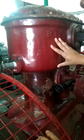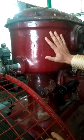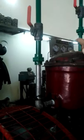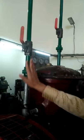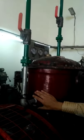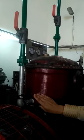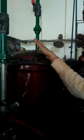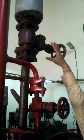For head cooling, there is a water jacket arrangement with pipelines. These green colored pipelines are connected to the head. The pipeline connected at the bottom side of this jacket is for inlet of cooling water coming from the cooling tower, and the other pipeline is for outgoing cooling water going back to the cooling tower.